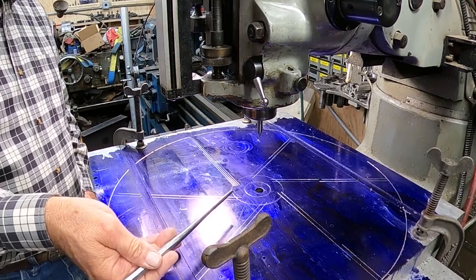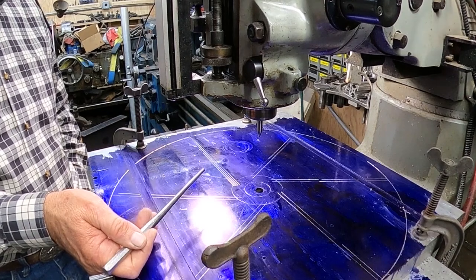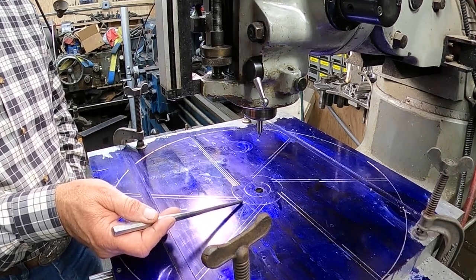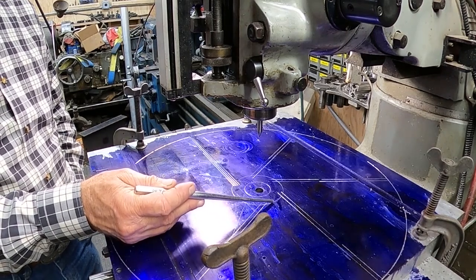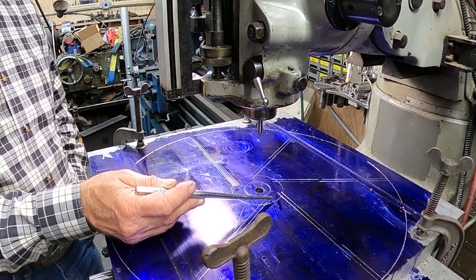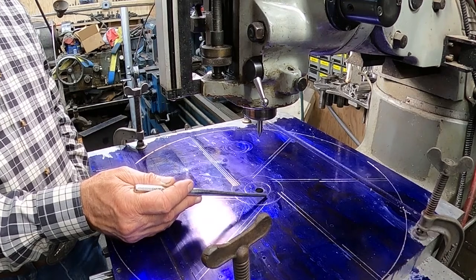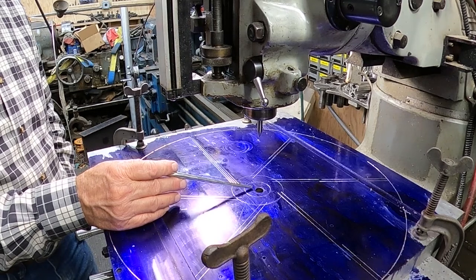And that's so that we can get that set screw in through this material and holding down this fan to the Arbor. So that's one of my issues that I'm going to achieve. And what I'll probably do with this, since this is aluminum, I'll probably put a set screw down, and it'll be a short set screw, and it'll tie this together, and then I'll run another set screw over the top of that to lock that set screw in place.